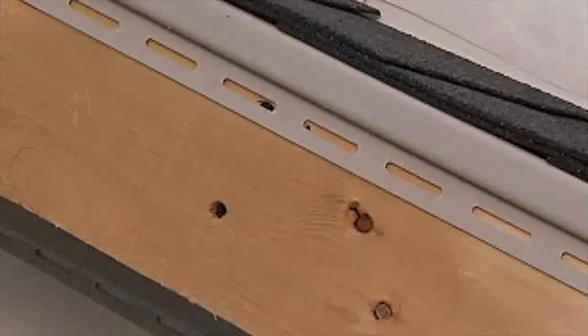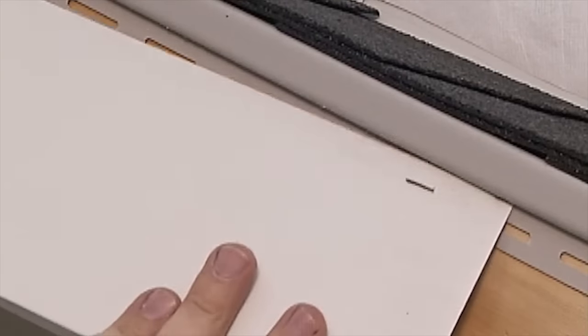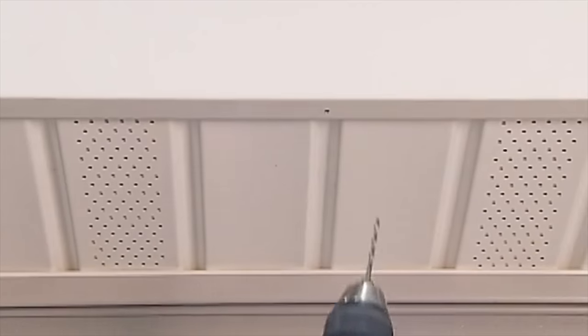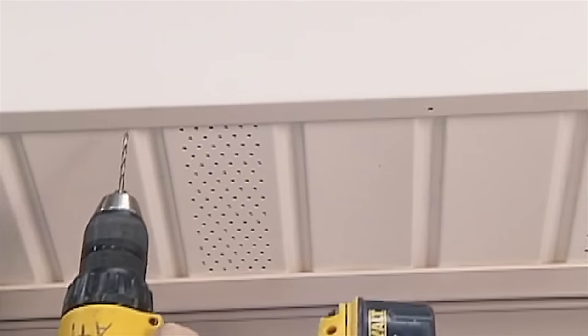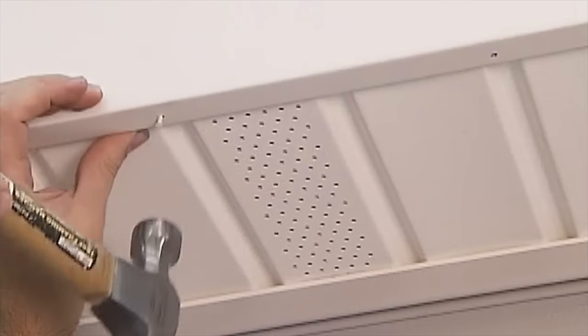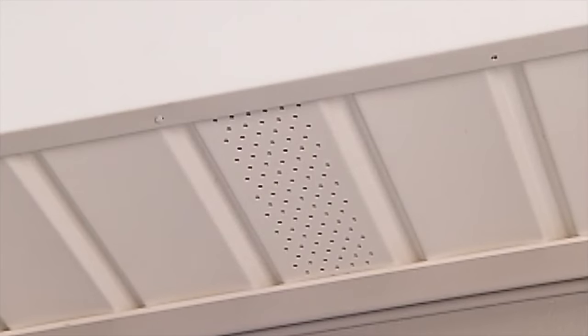If a drip edge is not present, utility trim can be installed to receive the fascia cover. In these situations, you can snap lock lugs onto the fascia panels. To install aluminum fascia, pre-drill nail holes a maximum of every 24 inches, aligned with the V-shaped groove in the soffit. Never nail trim sheet tight to the wood surface.